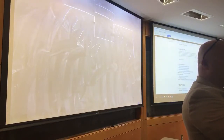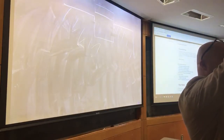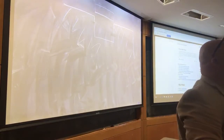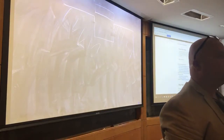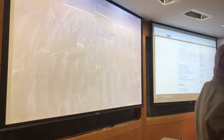What happens if it deflects too much? It breaks. What happens if it deflects a little bit? If it deflects just a little bit, the hole on the top and the bottom won't line up with each other, and it'll do this through the part. What if you have to have a long, skinny hole? What if it's real small diameter?